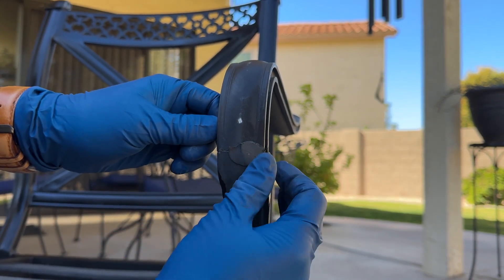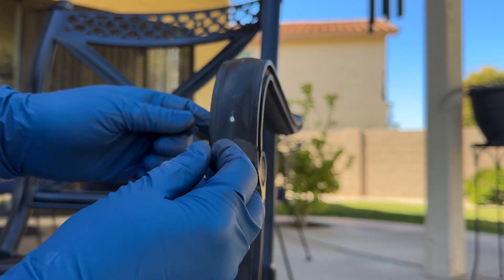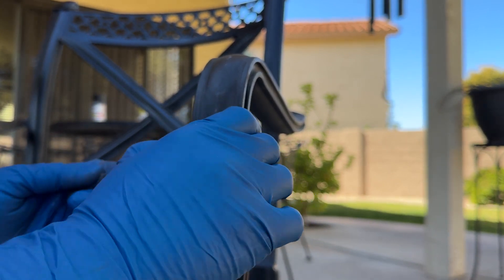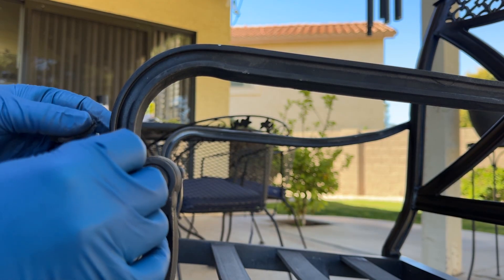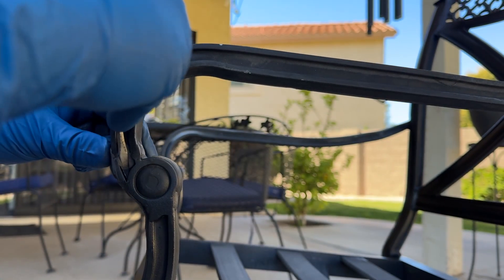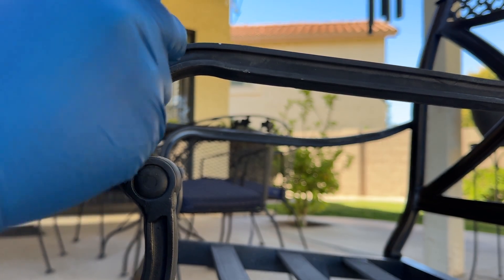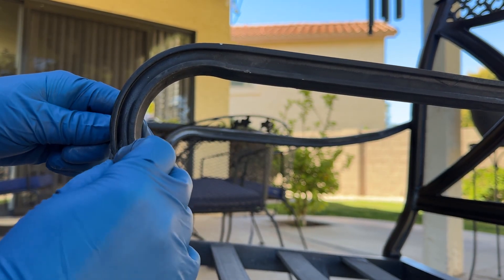I'm pushing it a little bit hard because I wanted it to go into the crack itself, to bond and bind the two pieces together. You can see I'm doing this with a very forceful push into the crack. There's also a little bit on the side of the chair as well — the crack was almost all the way through. So in this specific case, I'm going to use a screwdriver to shape the part, since I won't be able to use a sander in there to remove any excess. I'm being very careful to make sure I don't have too much putty left in there.